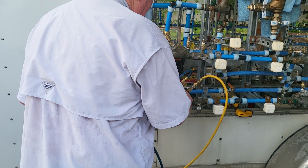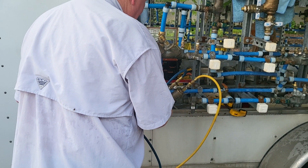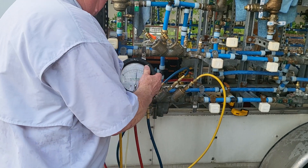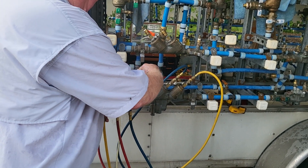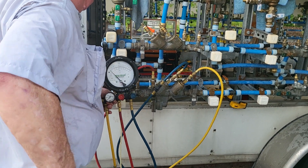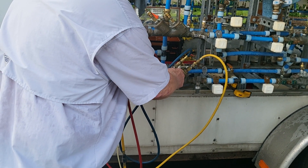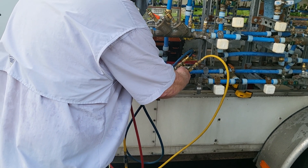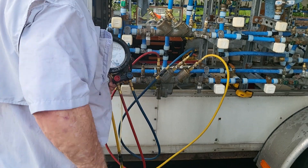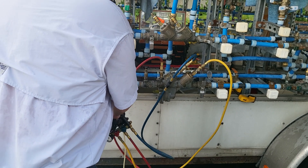And that's it. I like to close my testcocks — you can close them in any order you want. After you complete the test, how you do the rest of it is up to you. I'd like to close the testcocks and then open my bleed valve. What this is letting me know is if I left one of those ports open or not. If you leave one port open and just disconnect the hoses, you're going to flood somebody's home or business. Maybe lose an o-ring.